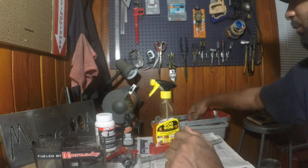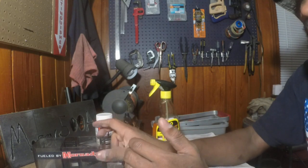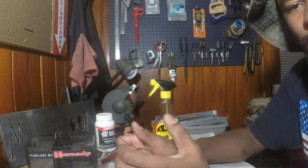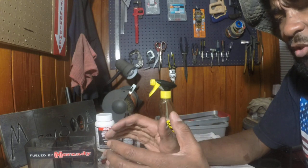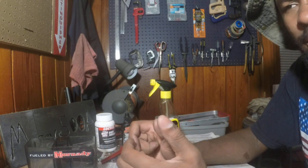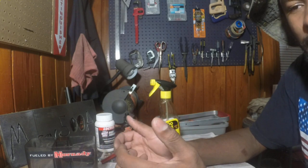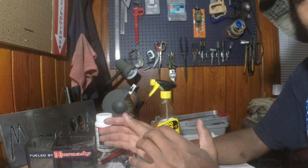back into this container. And you're not going to get all of it, because through using this, powder just seems to go places. So you'll generally have powder build up in certain areas. If you ever use grease or oil in certain spots, it may have collected a lot of powder over time, so if you're using this, you just have to clean it off. But right now, I'm doing a full clean just to get ready for a new brand of powder. That's one of the reasons why I had all the powder out, so I didn't have one brand mixed with the other.